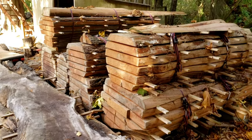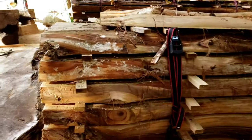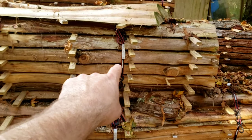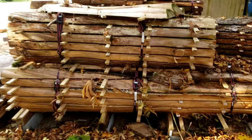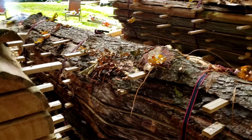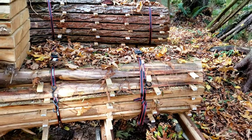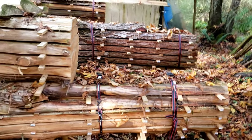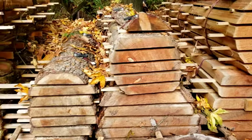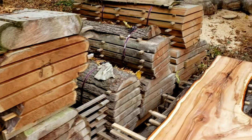The other key to ending up with super flat slabs in the end is proper stickering — not just stacking them up. We have all these stickered every foot, and also ratchet straps around it to hold them in log form. They are completely supported every foot all the way down the length of the slabs. When you pull them off, there's next to no warp, wave, or twist. They come out as flat as when you cut them. Preparation up front pays dividends on the back end — stickered every foot and they come out absolutely stick-straight when you pull them off the pile to use.